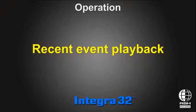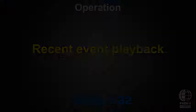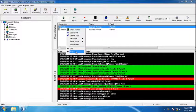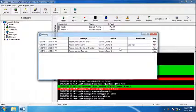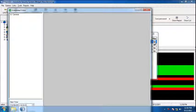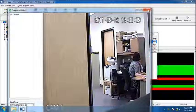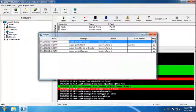Recent video event playback. We can look up a list of recent events by right-clicking on the hardware point, in this case the door, and selecting Play. A list of recent events will be displayed, and by clicking on the camera icon you will initiate playback of that particular event. Please note again the difference in recorded time and current time on a computer.